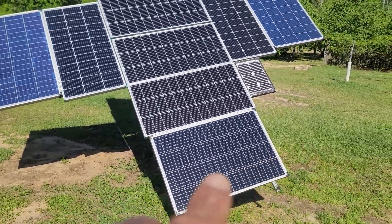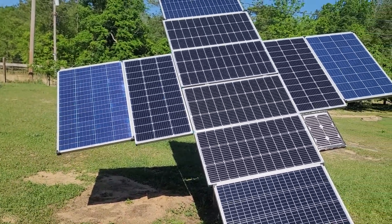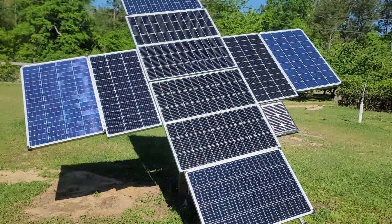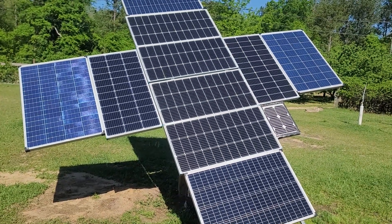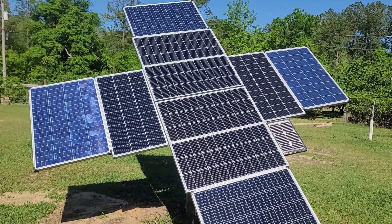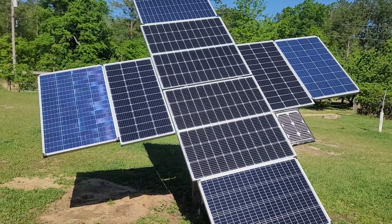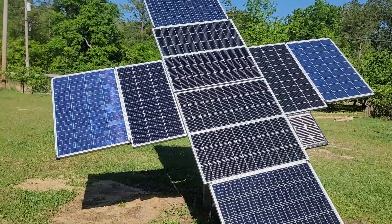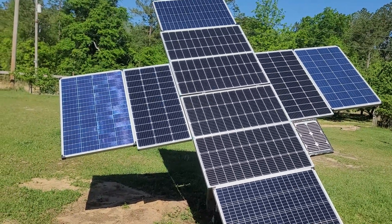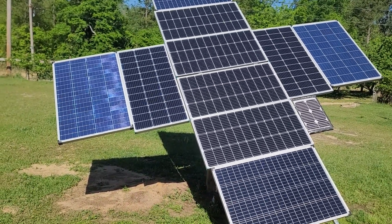I have added one, two, three, and four solar panels to this, so I have a total of 10 solar panels. The six that are already here are 100 watt solar panels, and the four that I added are 110 watt solar panels. I'm running these in parallel. They're not all hooked up together — the four 110 watt panels are on their own system and the six 100 watt panels are on their own system.